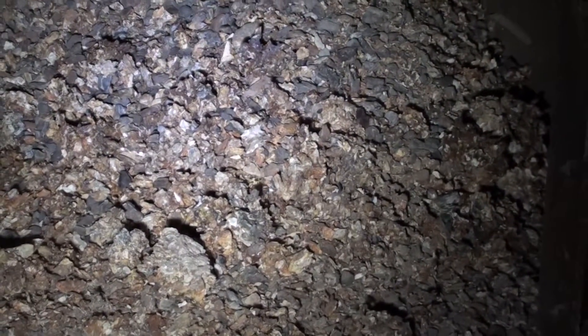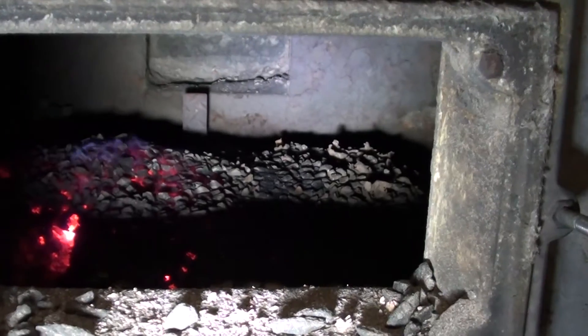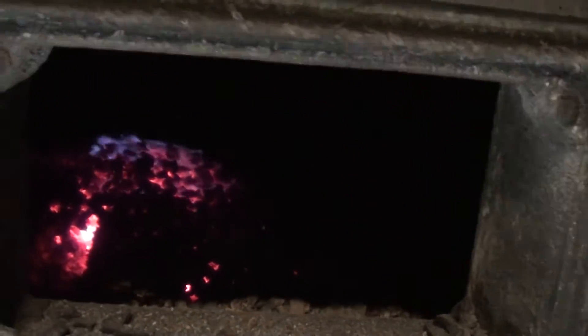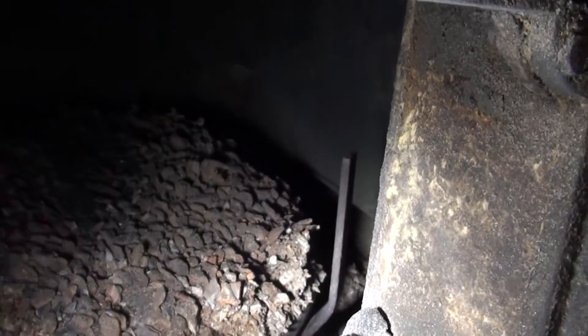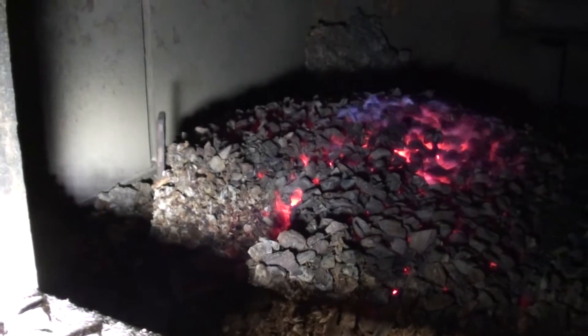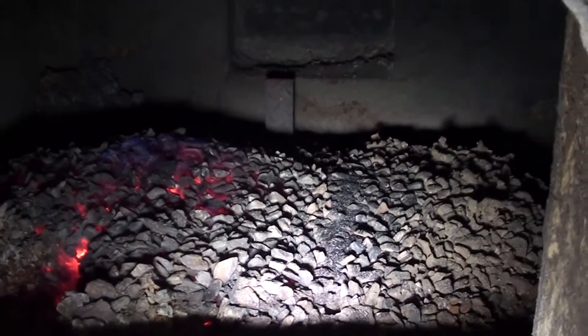We know the problem is on the right side of the pot. When it kicks on, the flame does not come up far enough — it's not burning the coal right. You can see part of the pot is actually burning, but this part over here is not; it's unburnt coal. You can also see there's a little arm there, and clearing the back is another one for the trimmer. Basically, when the unit runs, that just goes around real slow. You can see where the pot is burning and where it's not — we still have a problem.